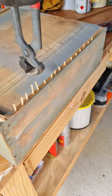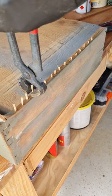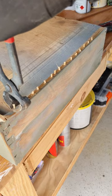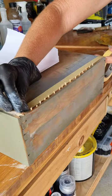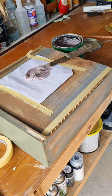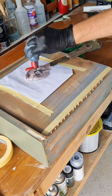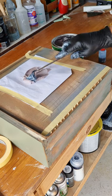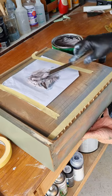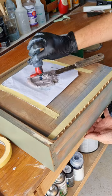height. For me personally, I find the skewers a better option over nails. The skewers can be easily sanded down if I'm a little high, whereas if I hammer it in further once I've applied the Bondo because I've gone too high, I find that you might crack the Bondo and undermine the join. A skewer will also wear naturally with the timber of the drawer as it moves in and out, whereas a nail will still protrude out because the timber's worn away on the outside, but the nail will still stick out, and that will eventually gouge back into the drawer frame.